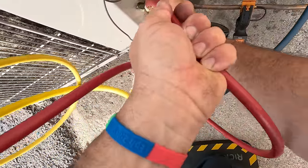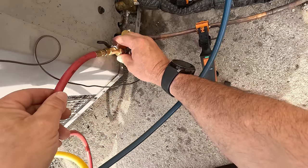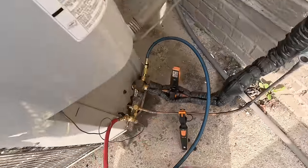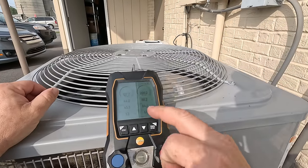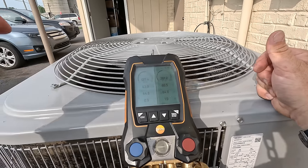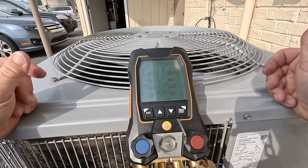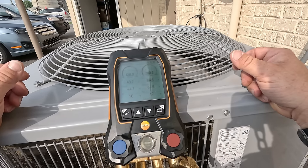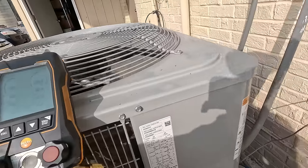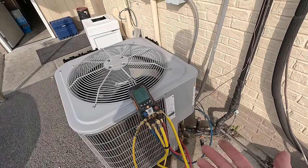Let's go ahead and see what kind of superheat we've got and do our subcooling too. Hopefully that inside unit has a TXV. I don't know if ADP will match up with this or not. Lennox never did well with anything but their own coils. ADP is a good coil for the most part, but we put it in a shitty spot. We are running an 86-degree condensing temperature. We have one degree of superheat and barely two degrees of subcooling. Subcooling says we're low, superheat says we're overcharged — or we have a malfunctioning TXV or an airflow problem. We've got right at a 130-degree differential between the suction and the head. Let's go inside and pop that cover off to see if the coil is plugged off with ice.